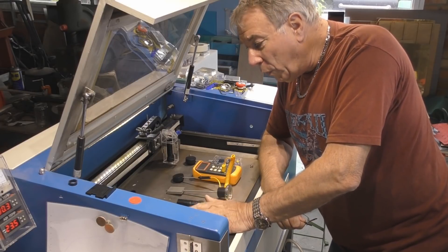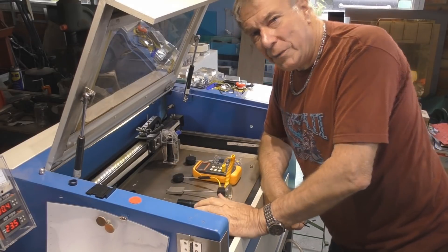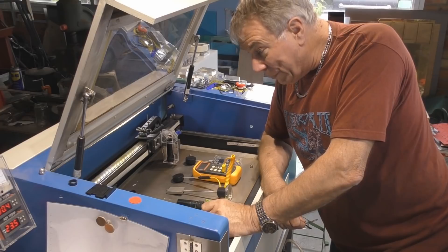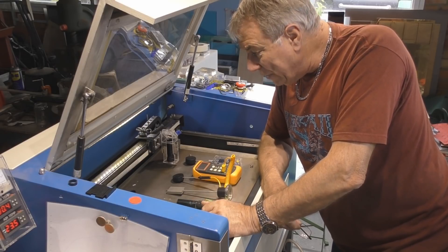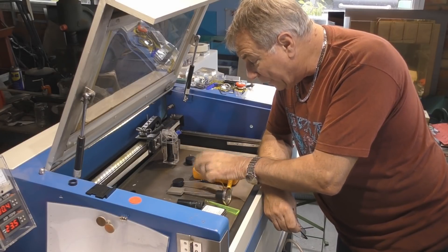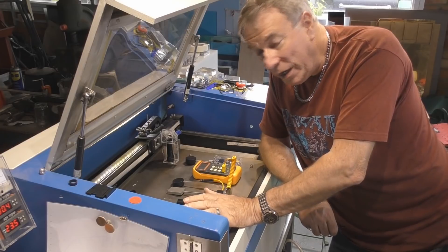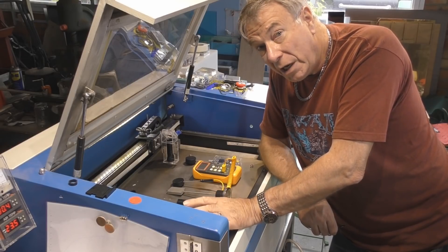The surprising thing we found about the cheap Chinese lens is it worked extremely well upside down — the way that it is supplied. I've always subscribed to the myth that the Chinese don't know what they're doing putting these lenses in upside down. Well, maybe we ought to give them a little more credit and accept that these lenses are put upside down because they work well as engraving machines. We've yet to find out whether there are more surprises when we look at cutting. I think this session on lenses is actually going to be three parts — the next session will be looking at power transmitted by the lenses, and then hopefully cutting. Thank you very much for your time, and we'll push on with our discoveries and investigations next time.